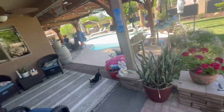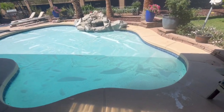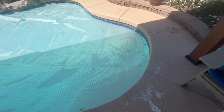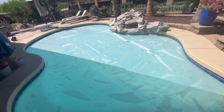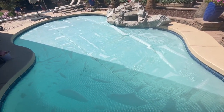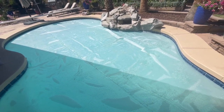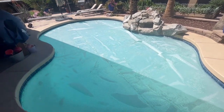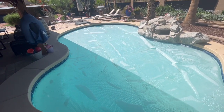One of the things I wanted to share: if you're going to heat your pool, you're going to get algae really bad if you don't keep that pool pump running 24 hours a day. Right now you can see it's nice and clean — no algae. But it got really bad mustard algae and I had to take the cover off for about a week, throw in a lot of chlorine, algaecide, clarifier, get it all cleaned out, and back flush it.